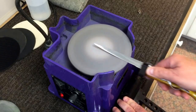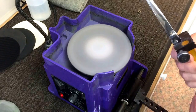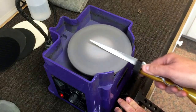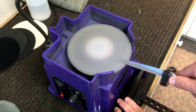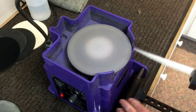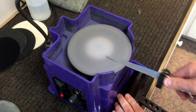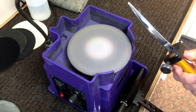Working towards the tip and back down. A little bit of dressing up in the throat area — I was missing that just a little bit, trying to stay out of the way of the camera. Working more of the blade, following that curvature up, and reconvexing that front surface. When I polish that out, all of this will blend in and that will alleviate any irregularities of the shear.